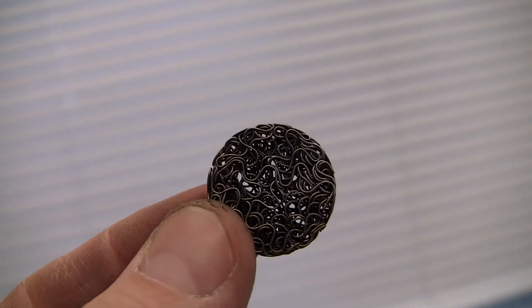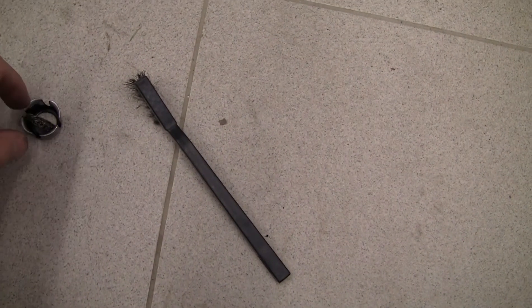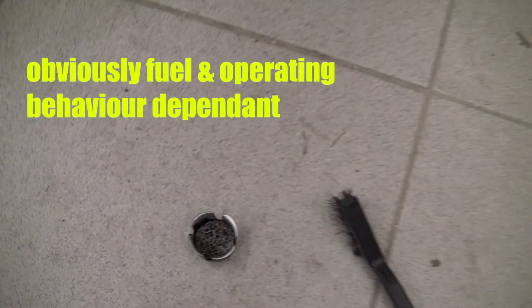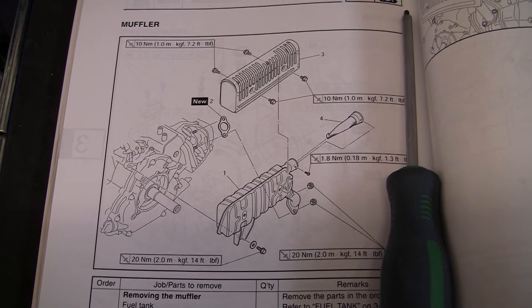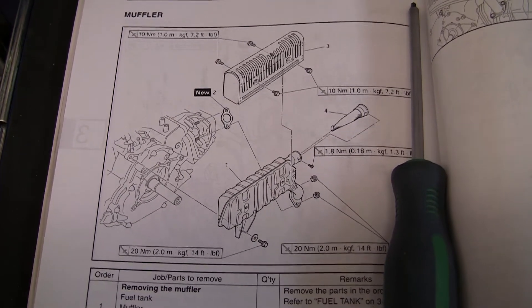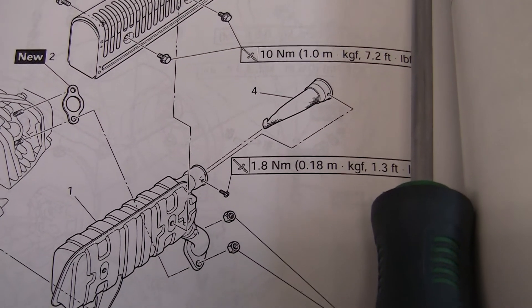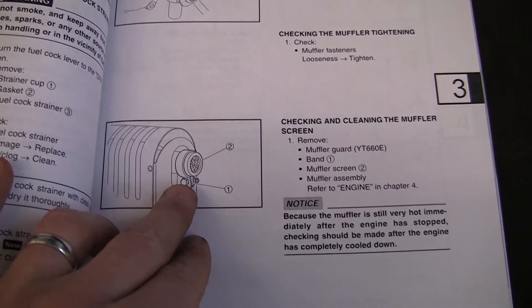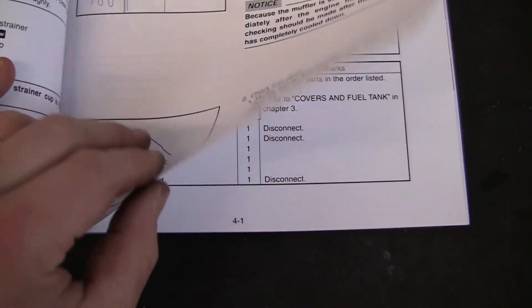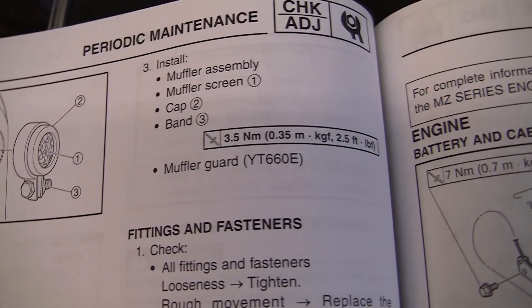You can see in there really nice — it wasn't jammed up or anything. Even a brushing produced nothing, so I really wouldn't worry about contamination. I'm four years in and all good. As a note: when looking up the exhaust screen torque, we noticed the previous version had a screen-style spark arrestor versus a mesh style. The snowblower service manual has the style on our unit, and the torque is 3.5 Newton meters for the band.